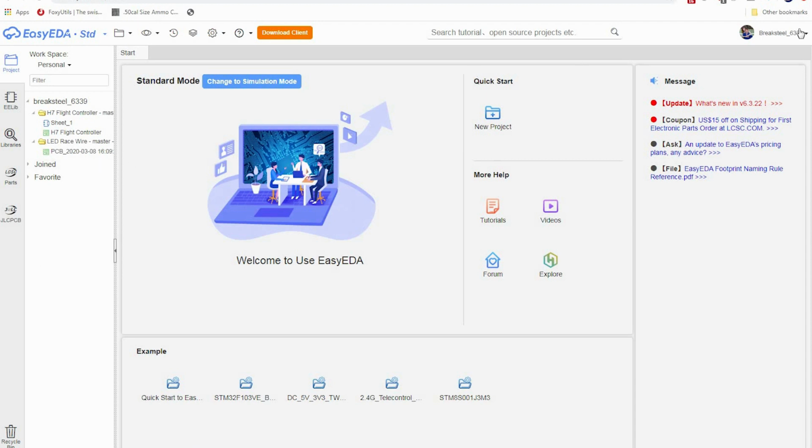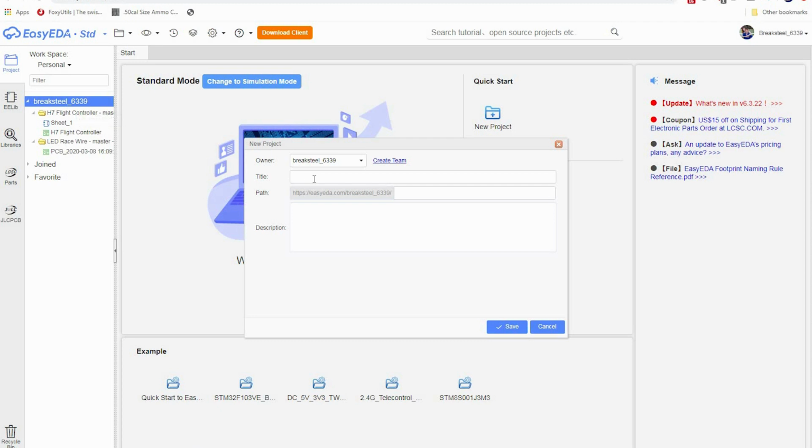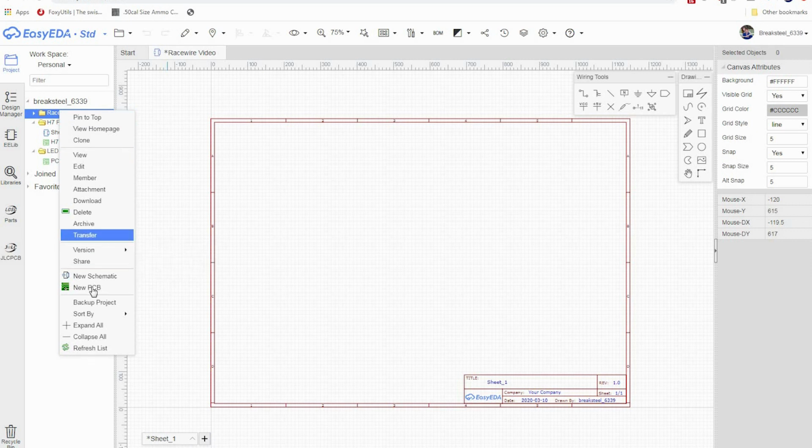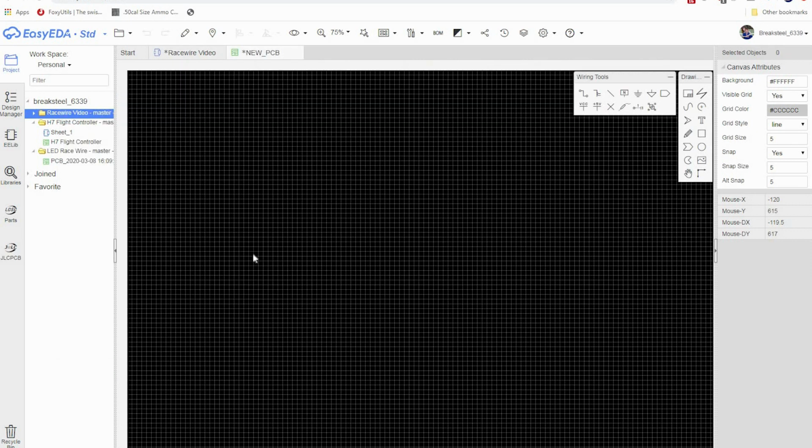Okay, so go ahead and start an account if you don't already have one. I already have one, so I'm going to go over here to project. I'm going to click on my name and click new project. We're going to call this race wire video and click save. That's going to give you a schematic. We're not going to use this. Go ahead and click on the race wire video folder, right click and scroll down to new PCB.